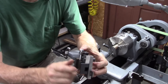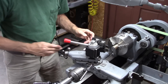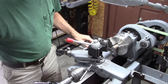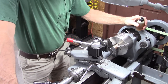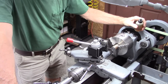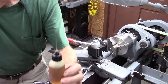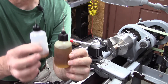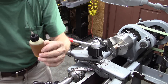Tool height needs to be on center or very slightly above. RPM needs to be whatever the correct speed is for high speed steel — like three-quarter inch ends up being about 500 RPM. If you don't have one of these, I highly recommend it. It makes several kinds; this one I really don't like, this one's ideal. I don't know where I got it from, but if you can find that one, it's ideal.